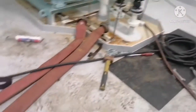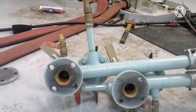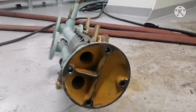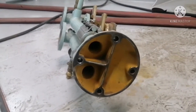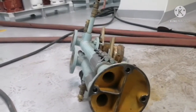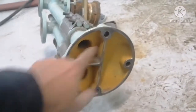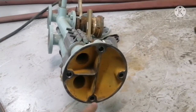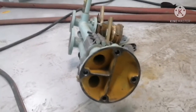It is all completely clean and ready for boxing up. You can see the other pipe flanges — also very perfectly cleaned and ready to fit up. The end cover is also cleaned. Now we will box it up. You have to keep the cover position correct — you cannot put it upside down. If you put it upside down it will change the flow: inlet will go to outlet and outlet will go to inlet. So be careful when fitting back the cooler and flange.